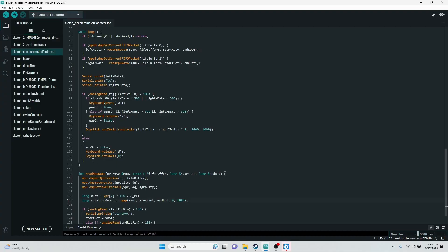The Arduino board is running this program — I put a link in the description. It's based off my earlier video where I connected two accelerometers to the Arduino board. The difference with this one is that as part of the loop, you're using the relative rotations of the two accelerometers to press and release the gas button and to set the x-axis of the joystick.